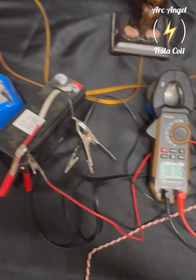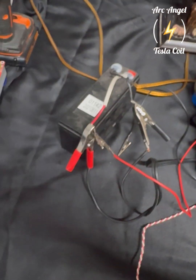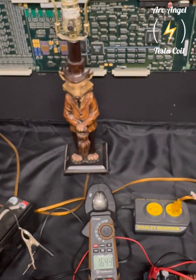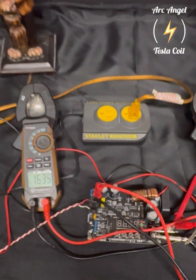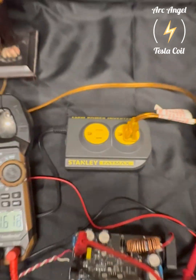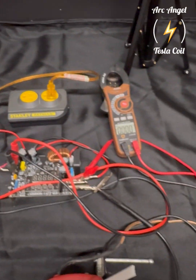I'll be charging a battery at one point in this video — it's a 12-volt battery that you see there. The buck I'm using at the beginning is a step-down buck, so you can have a higher voltage coming in and it regulates it down to a lower voltage.